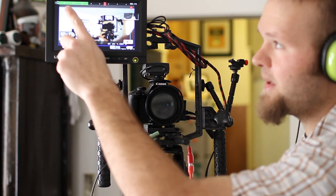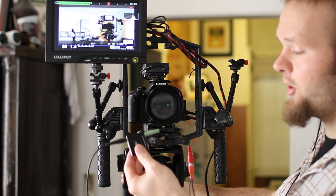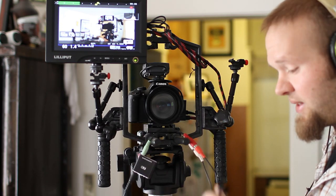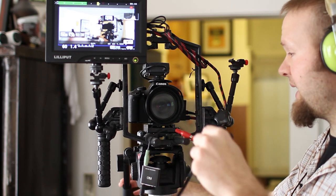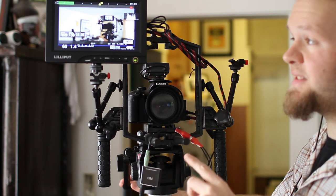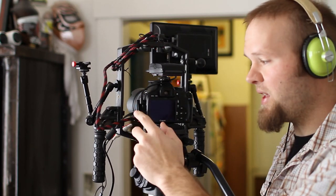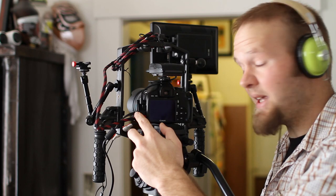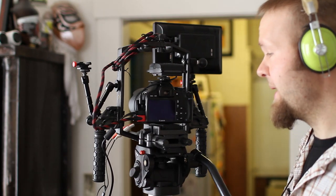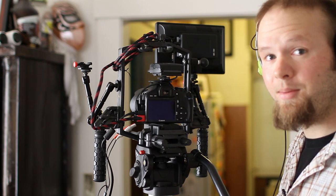You'll notice that I'm getting audio levels up here from my Magic Lantern T2i firmware update. I am also monitoring the audio via this little headphone amplifier and this Y cable connector right here that goes to the composite USB cable on the Canon T2i. The nice thing is that the monitor HDMI port on the camera works at the same time as the USB port. So if you flip this around, you'll notice that I have both the HDMI and the USB port plugged in, and I can listen to the audio that I'm recording right now as the camera is also outputting to the monitor. This is extremely handy, and it gives you the audio application that you probably wanted for your Lilliput monitor.